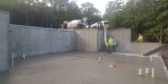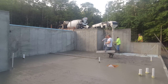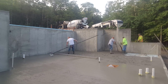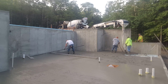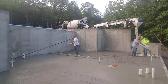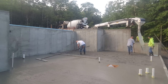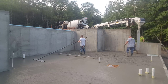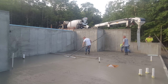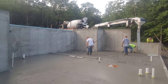We've been using these conveyor trucks for probably 15 years now. Just recently they got this one that extends in and out — that makes it pretty handy. Before, we always had to move the truck back and forth every four or five feet depending on where we wanted to move that boot. We've got one guy bull floating over there. Having three guys makes this process pretty easy — four would be even easier, but three is a pretty good number for doing most residential floors.